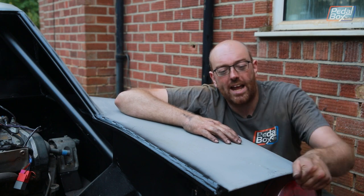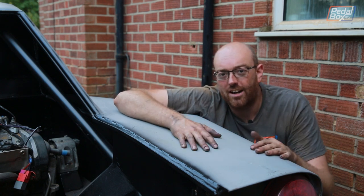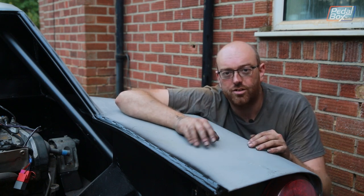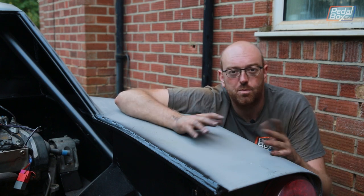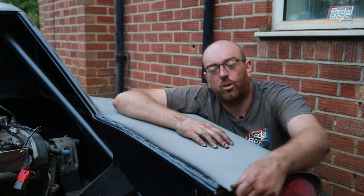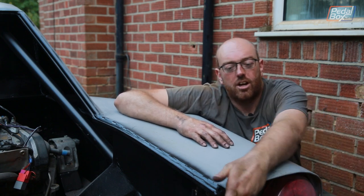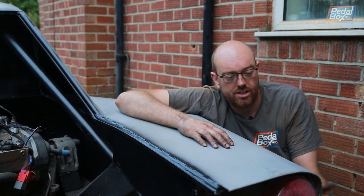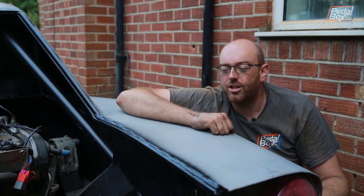Now on the very back edge, we need to have these panels rounded over. These are just 0.9mm sheets that just ended and you can't have that - you need a 2.5mm radius so that you don't injure people if you're reversing or they bump into it, which seems perfectly reasonable. So I've welded on some 5mm rod all the way around this outside edge, so now we have a 2.5mm radius across the back, which is really nice. It's come together really nicely and it's given the back of the panel a little bit more strength to boot.